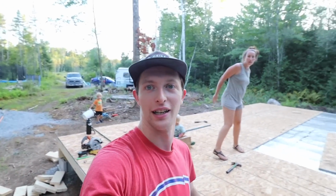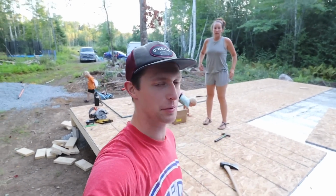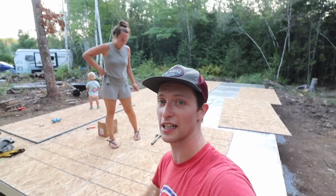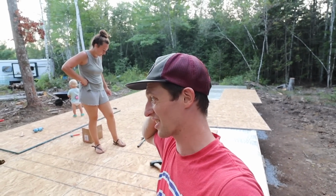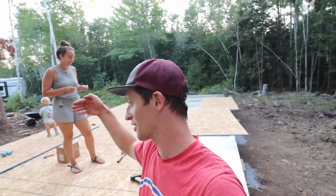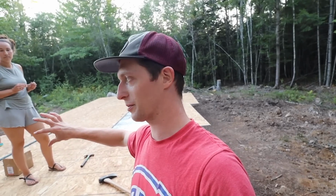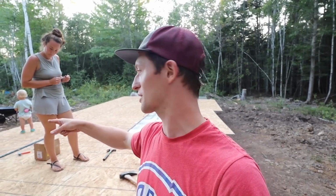Okay, everybody, I don't think we filmed any of it last night. We had a little bit of a tough time getting this sheet of OSB in yesterday, realizing that we had started it backwards with the groove facing out and the tongue facing in. I think, by what I watched after we started and nailed them all in, it would have been easier to do it the other way.